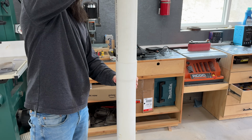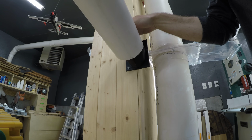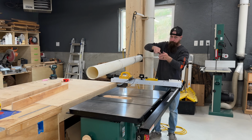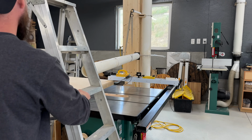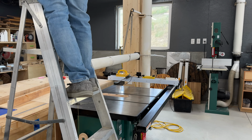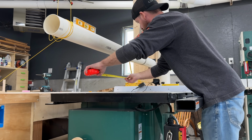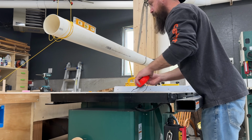Starting with my criteria, and it's in no particular order because I find them all to be very important. CFM. To maximize the effectiveness of this feature, or any true dust collection system for that matter, it's achieving the highest amount of CFM flowing at the tool, or to be more specific in this application, the blade. For my design, I'll be using 4-inch duct for the overarm.